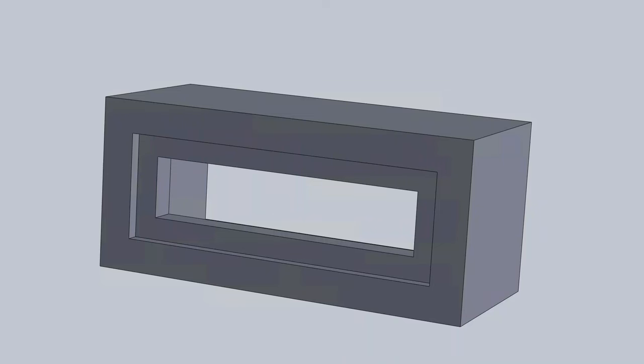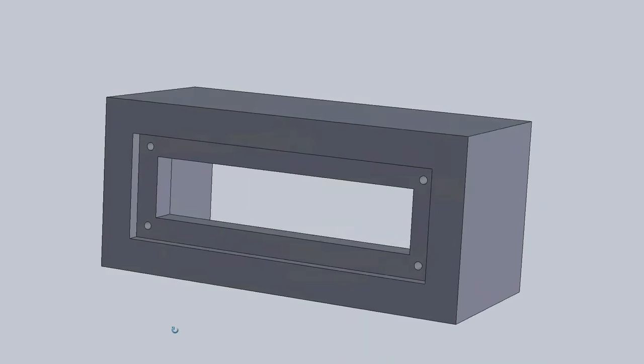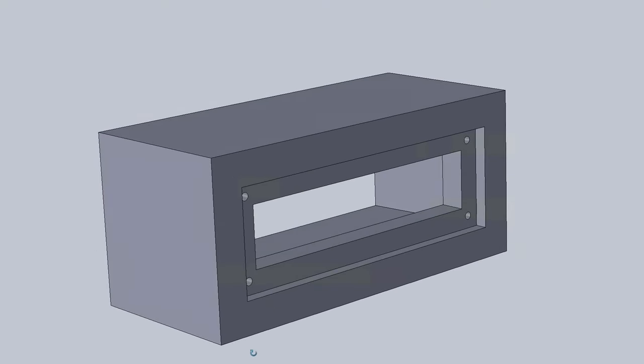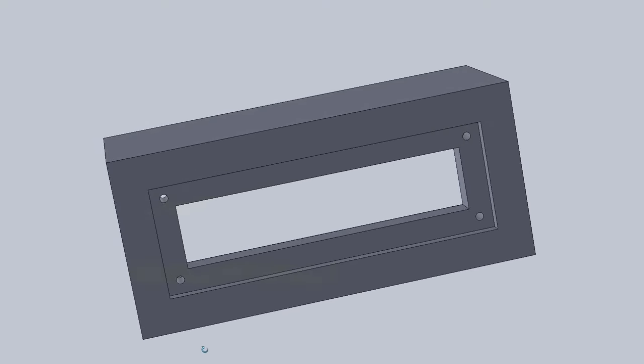And that gave me an idea for the enclosure itself. See, I was going to have to attach the mounting plate somehow. I had been thinking about casting holes in the front of the enclosure through which the plate could be bolted, but casting narrow holes sounded hard, and getting them in the right position sounded even harder. I didn't think I could cast around a screw to leave a threaded hole. Even with a very chunky thread pitch, it would almost certainly crumble the first time it was used.